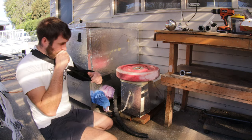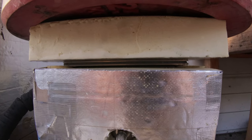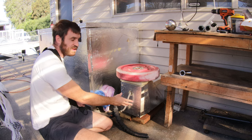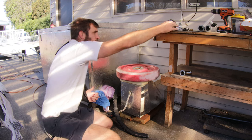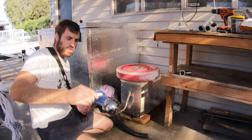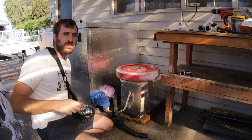This is only temporary — once my arm's better I'm going to rip all this insulation off and put it on a lot better. We've currently got a 25-kilo weight on top. That sits atop a block of insulation where it sits on the plate, and that holds the plate down perfectly with no steam leakage. The reason for the weight is that if pressure builds up inside, it will actually be able to lift that weight up. I also have a new ball cock here — I haven't used it because it arrived late. The type designed for it has a kink in it, and it raises slightly higher, so if it intrudes on the top you just need to bend the arm slightly down.